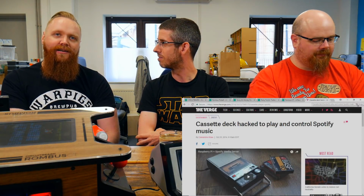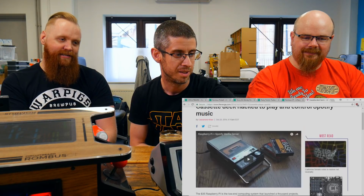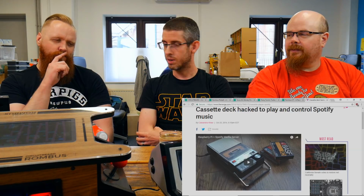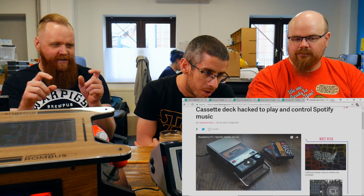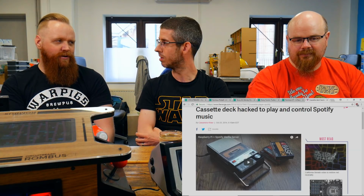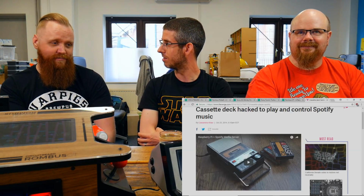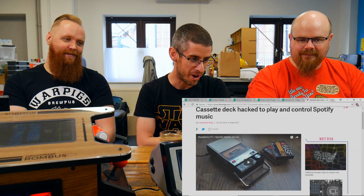Yeah, this is probably the first hack that I've done, which is the Spotify cassette player. It's so old that I didn't even have a blog then, so I get a lot of requests of how I did that, but that was pretty cool. So, like I say, taking old tech, reimagining it. That was a cassette player. The cassettes had NFC tags in either side, and when you put it in the cassette player and press play, it read the NFC tag and chose a Spotify playlist to play. And you could flip the cassette over as well, so you had two sides.